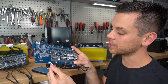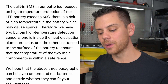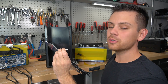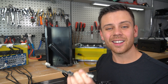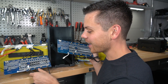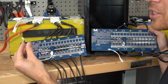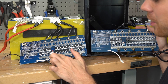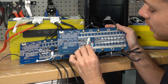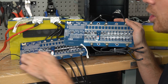You have one temperature sensing unit, not two. They say the other one is attached to the battery to ensure the temperature of the two main components is within safe range. It is true that the high temp sensor is on the cells, but you need low temperature charging protection — and that is an issue. I have the same exact BMS right here, and this one was assembled properly. We have a temperature sensor for the cells and a high temp sensor for the MOSFETs. Does this one have those? No, it does not. This was misplaced — whoever is assembling your batteries is doing a bad job, and there is no temperature sensor attached to the board when there should be.